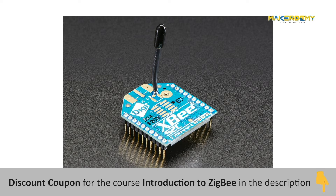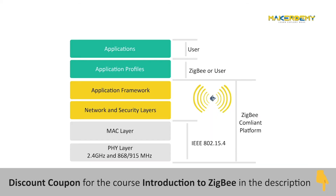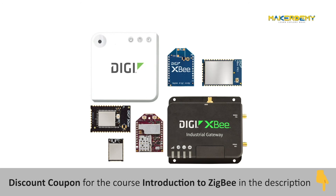To be more precise, we are using the XBee S2C Version E Module. The XBee S2C is an RF module designed for wireless communication or data exchange, and it works on the Zigbee communication protocol that sits on top of IEEE 802.15.4 layers.